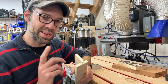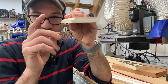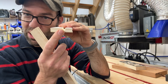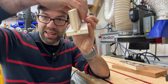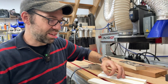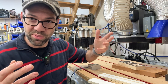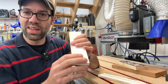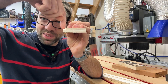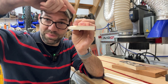The math for your cut depth works a little bit differently when zeroing to the work surface. This rabbet needs to be exactly a quarter inch thick, and we want this dado to always be a little bit over a quarter inch so we get a nice fit with just a little glue clearance. To set up this toolpath, you take your average thickness of a sheet of plywood — sometimes just 0.5 — knowing it actually nets out to 0.48 or 0.47, but that doesn't matter. When the toolpath calculates for this rabbet, instead of starting from the top and pushing the bit down a quarter inch, it's going to start from the bottom and pull the bit up a quarter inch. That's a critical difference.